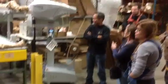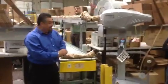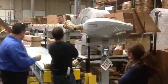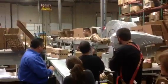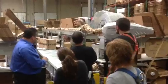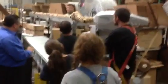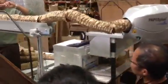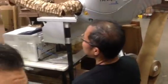Who's working on this side? Cameron, Raquel, and Arlino. Guys, if you're working on this side of the pack stations, this conveyor is not bolted down yet. So we still have things to do to it. If you start seeing the paper coming off and it starts jumping or skipping, check the cord coming out, make sure it's up high enough. Number two, since it's not bolted down, there's a tendency for the conveyors to come out of line. If they come out of line, push them back in line, and it'll slide down.